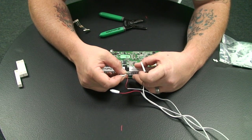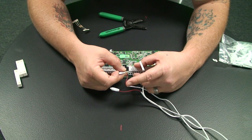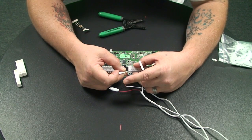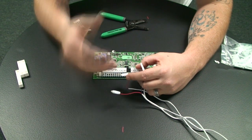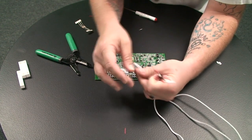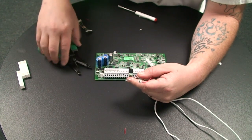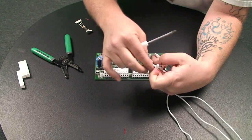And that's how that will work. When any one of these windows opens, that will force the zone to open, causing the alarm to go off or show an open circuit on your control panel. When the circuit is open, you'll have something displayed showing zone one, or whatever zone you choose to use. Make sure when you cut your wires that you have just enough to fit into the terminal — this way you don't have any exposed copper wire sticking out. You can leave a little exposed on the resistor, but I like to trim it down a little bit.